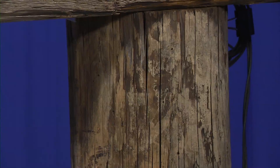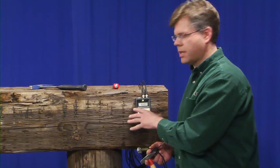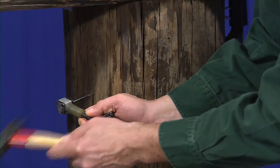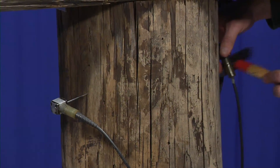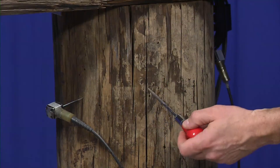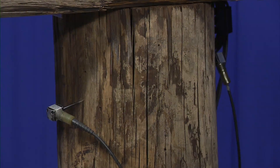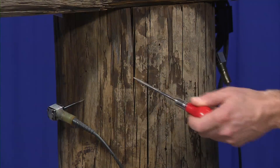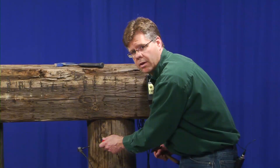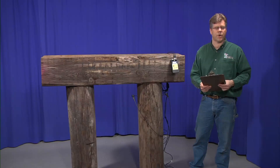One important thing to consider is whether we have the presence of deep cracks in our pilings, caps, or other timber members, because it can give a false reading using the stress wave timer. If there is a deep crack that goes through the cross section of the member, the sound wave has to travel around it, meaning it will take more time to reach the stop transducer. We want to be very careful and understand the depth and presence of cracks — specifically the ones that might extend one half of the way through the cross section.